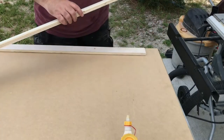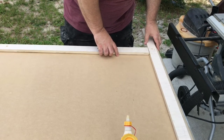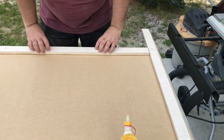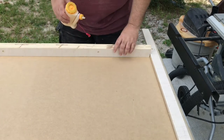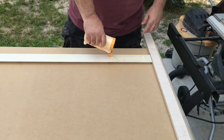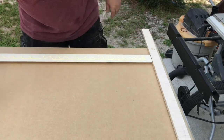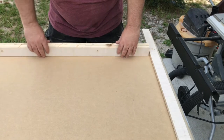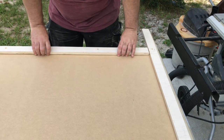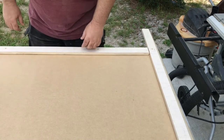With two straight boards it's time to start assembling our jig. I aligned the two boards in a basic L pattern — things don't have to be perfectly square at this point, I just need to know approximately where things are going to be. I'm going to attach the first board before measuring anything for square. I'll do this by applying glue to the board, turning it over, getting it where I want it, then pre-drilling and screwing it down.